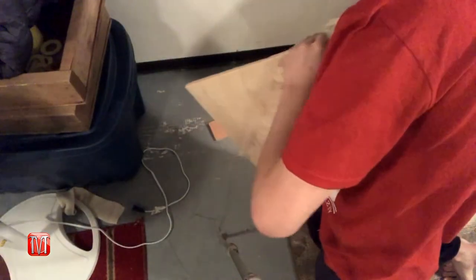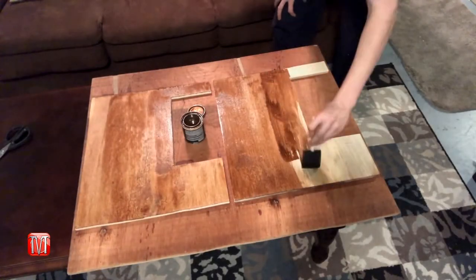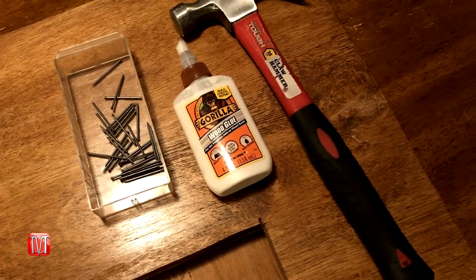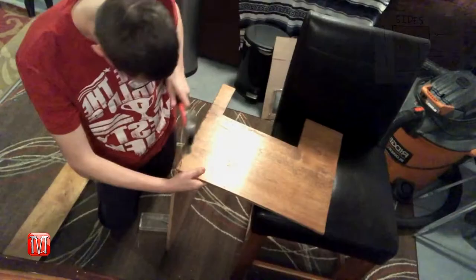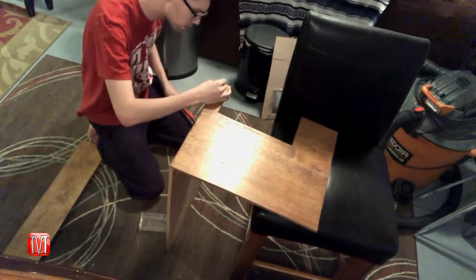I will be using half-inch plywood to cut out the parts that form the outer body shell. Sand each side smooth, then stain and varnish the exposed sides. Once dried, it's time to start nailing those pieces together — apply some wood glue to help bond the frame and nail each edge using one and a half to two inch finished nails.